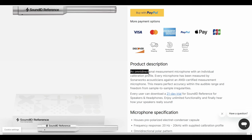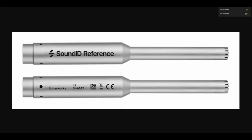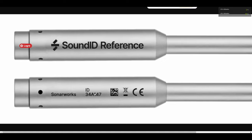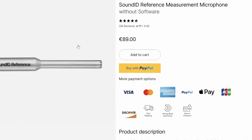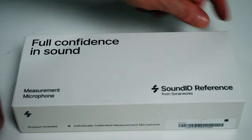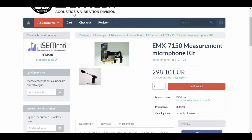There are some benefits to more expensive microphones with calibration files. A calibration file means the manufacturer has tested that microphone to ensure it's within their tolerances — it's a form of quality control. Build quality is another factor: a really cheap microphone will break and you'll have to replace it. But the takeaway is that if you're just getting started, just buy a cheap microphone — the one I got was about $90. When you're a beginner, you want a mic you're not afraid of losing or breaking. If you're doing system tuning regularly for work, invest in something around $250 to $300.